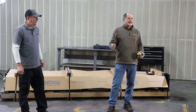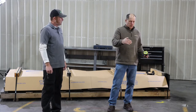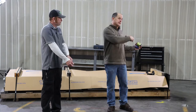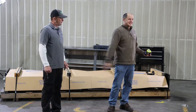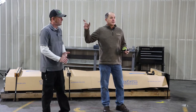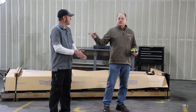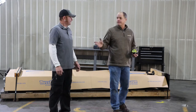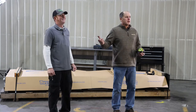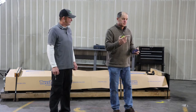We're going to start by showing you how to lay out your shop for the lift. Find a consistent place to measure off of — it might be the back wall or the front wall. You need consistency so you can snap a line and know where everything's going to be. With me is Eric Forsen, here at Nussbaum Automotive Solutions in Gastonia, with the company seven years. We're going to measure our lines and snap a line to get this thing going.